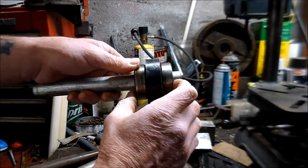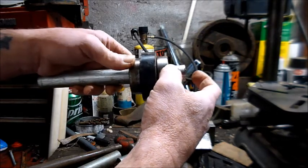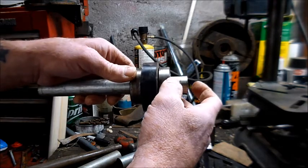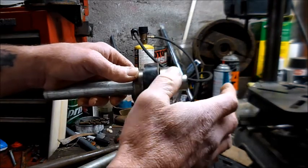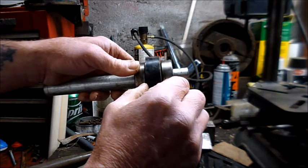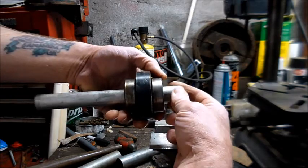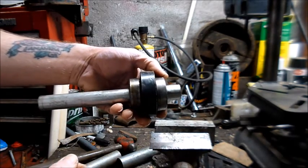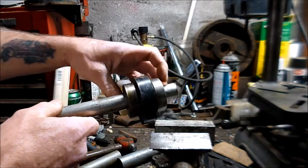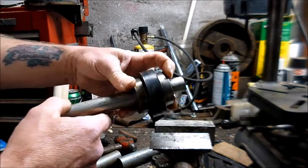Before, when I had just assembled it, it was a little stiff. The bearings and the spacer were tight together. So after it was installed in the headstock, I drove it back and forth just a little tiny bit to create a little bit of motion so that those bearings would turn freely inside the headstock. There may be a right and a wrong way. I'm sure there is. I don't know it. This is just what I did, and it's worked fine.